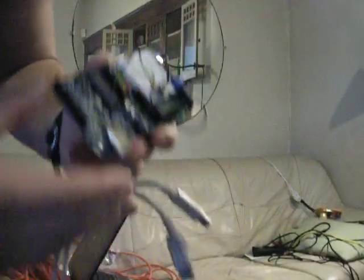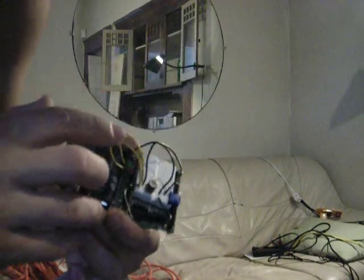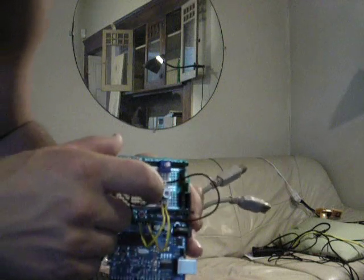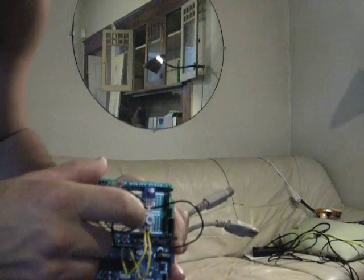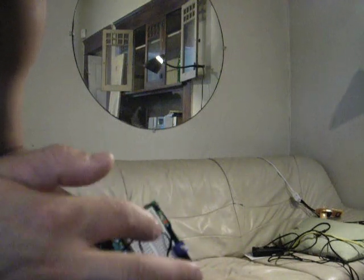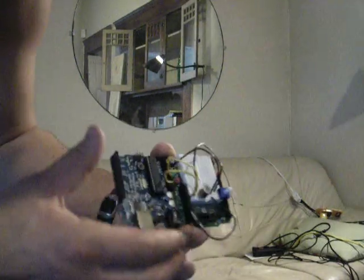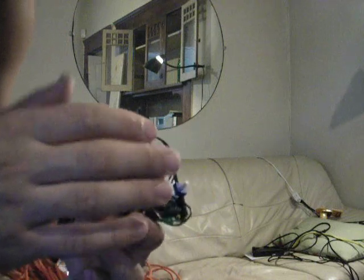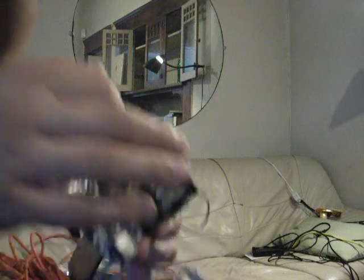What I've done to wire this is — for power we're just using the 5-volt line, running it to the two sensor pins on there from the datasheet that I'll link to for the TGS2620 sensor. Then we're putting a potentiometer in line to adjust the resistance. This is the 1K potentiometer that came with Lady Ada's kit. And then we're reading the output from the VOC sensor in series with the potentiometer on the analog input on our Arduino.